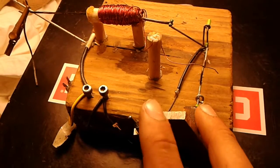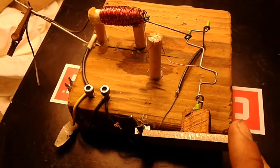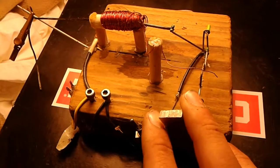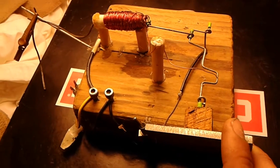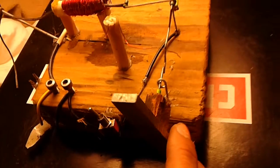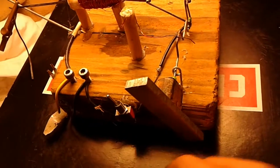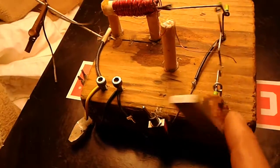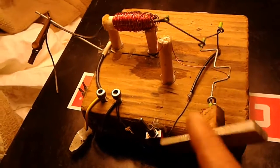That energizes the solenoid, pulls the nail in, solenoid core. So here it energizes, pulls it in, it de-energizes because it's no longer touching that wire. The kinetic energy of the flywheel carries it around until it gets to the energized stroke again and flies past, and then that causes it to continue to rotate.